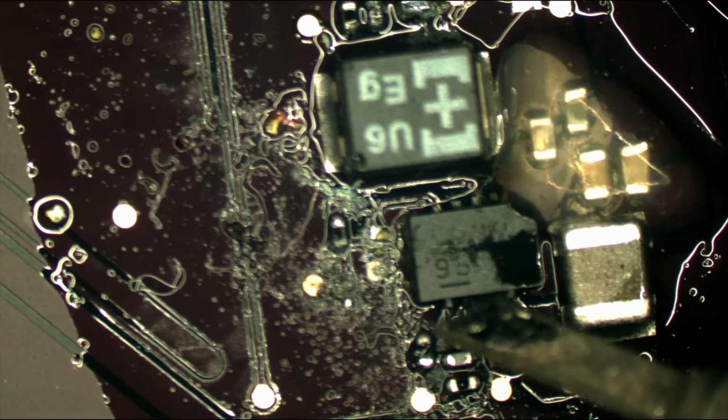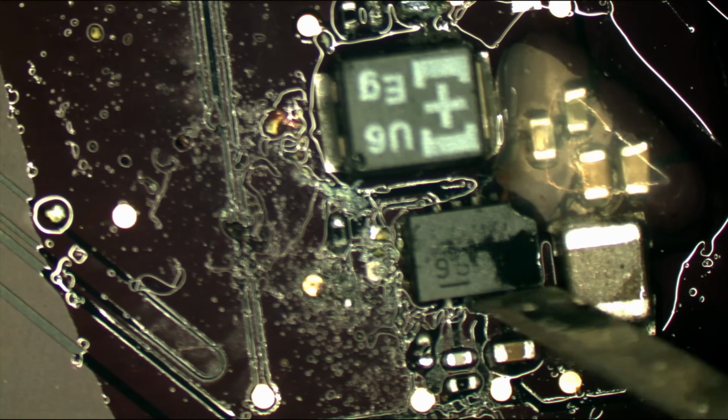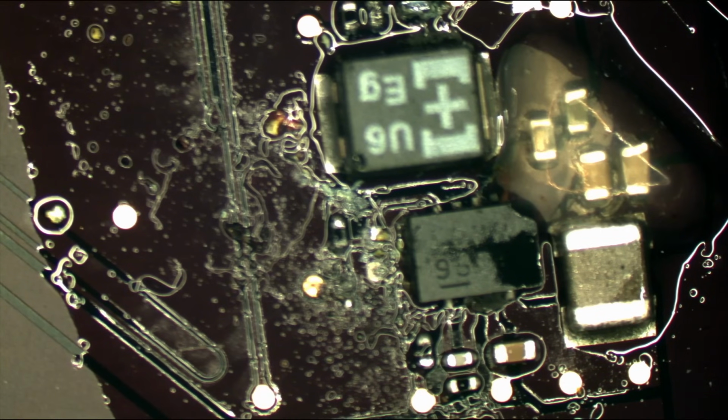See how this is shaped like a knife? You're going to want to be adding solder, but kind of like filing your nails, back and forth over here. The whole idea is to reflow these joints in the bottom right that look bad. I want to see you add the right amount of flux. None of that pulling.